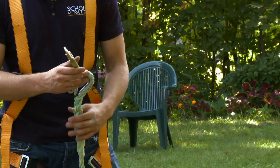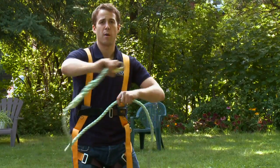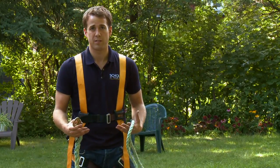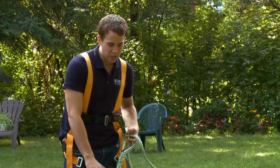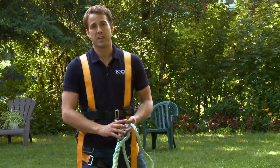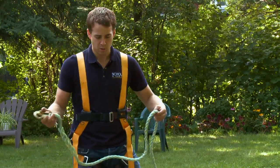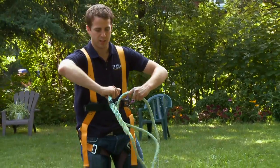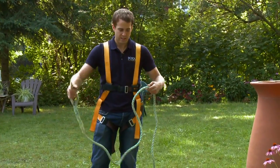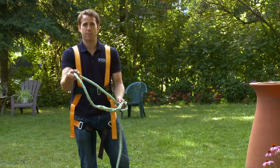This carabiner can connect to the home in two ways: it can connect to the roofing anchor, or it can connect around a strong point such as a chimney or any other strong fastening point that can hold at least 2,000 pounds. Things you don't want to wrap around include a ventilation duct or something related to heating that's only a foot or two off the roof — not strong enough. So we take our rope, wrap it around the chimney, make sure it's well-seated, wrap it to itself, pull it tight, and we're good to use our rope.